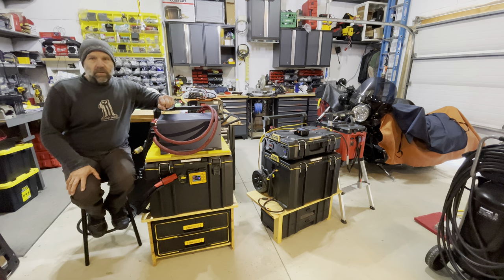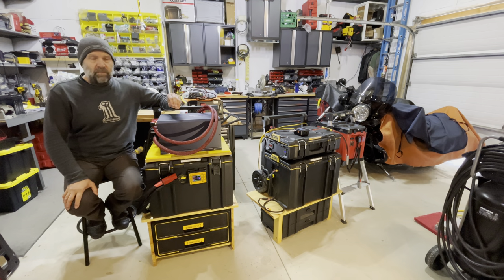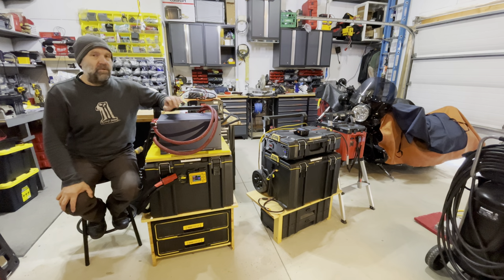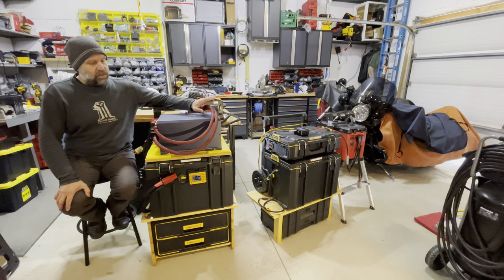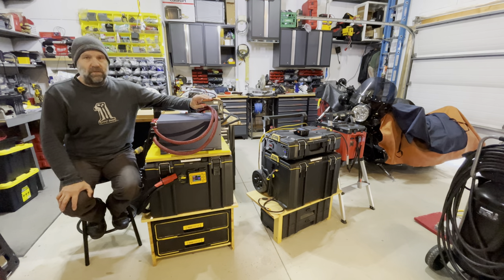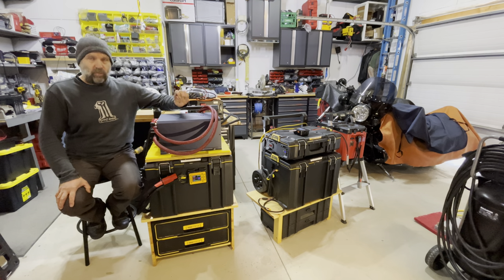Here's some show-and-tell on the 24-volt setup — it's 8S, so just like one of my previous builds it can also be set up as 12 volt, 2P4S. The joy of using 24 volts: with a four-aught cable you can do 3,000 watts, but at 24 volts you can do 6,000 watts. You can double the capacity of what the cables can handle going from 12 to 24 to 48 volts, and the power factor works the same way.